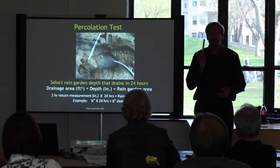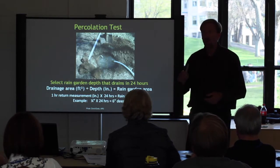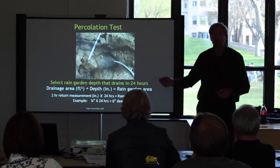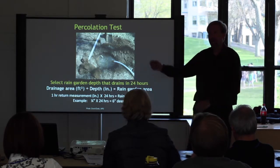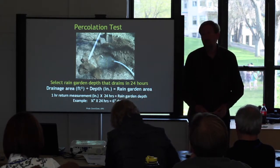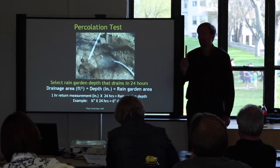What if your hole's empty? Now, well, hold on. If you are going to do this in the summer, then I would do it differently. In the summer, I'd fill the hole with water, go to work, come home, fill the hole with water, have dinner, come back out, fill the hole with water. You're not measuring, you're just filling the hole. You're trying to saturate the ground. You fill that hole up 3-4 times, then you put in the tongue depressor and measure.